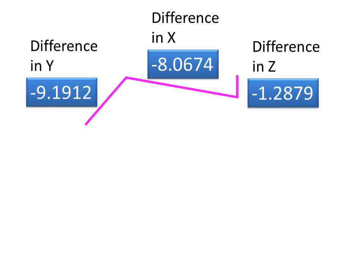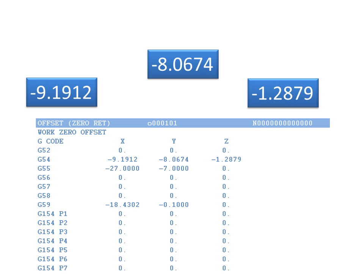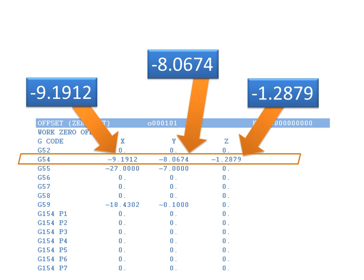So what we can do is boil this down to just three numbers: negative 9, negative 8, negative 1, with their respective decimal places. And we can have the machine store those values for us. There is a place in most controllers called the offsets page where the work offsets are stored. You'll see here ours is being stored on the line G54. So we have used the controller to record the position of our coordinate system offset in this offset register, and the particular setup we've measured is listed as G54.